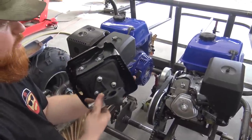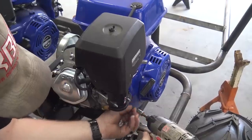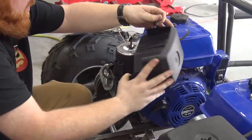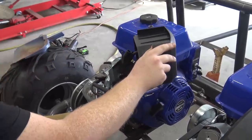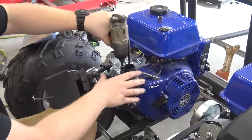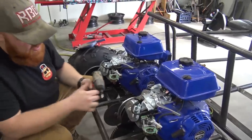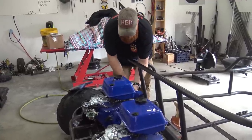This has got one of those weird mufflers that have a little - I don't know if that's like an EGR type thing or what, but it's weird. The muffler is two 13mm nuts. There's a vacuum up top, vacuum on the valve cover - big blocks, any big block engine has a nut under the airbox holding it on as well. You can take this top part off and there's another 10mm right here on the back. The gas tank has two 10mm bolts on the front and half-inch nuts on the rear of the gas tank.